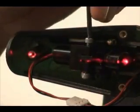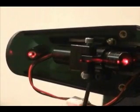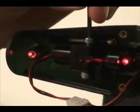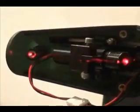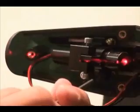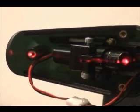Once the laser is aligned on the red lens, first tighten the green screws. This will keep the laser line angle aligned. Then tighten the black and silver screws to secure the laser. Make any final adjustments with the green or yellow screws to achieve optimal sensor readings. Check all tuning screws are hand tight.